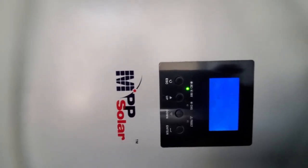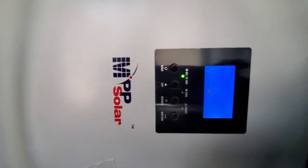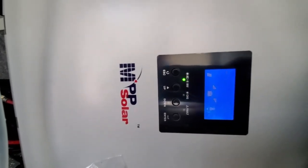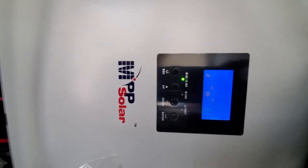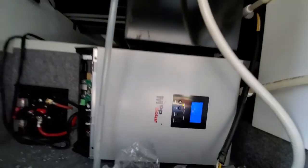So there it's pulling. We've got two 340 watt panels up there. I think they're still in the sun a little bit. The sun is now nearly 5, 6 o'clock here in summertime here in Utah. And so we're getting about 50% of that power, and it's busy charging our battery. I'm not sure if you can see that clearly. 313 watts. Okay. Took a long time to get there.